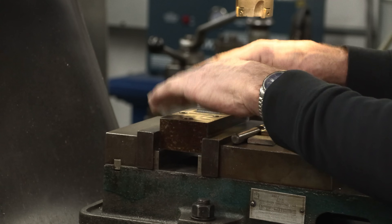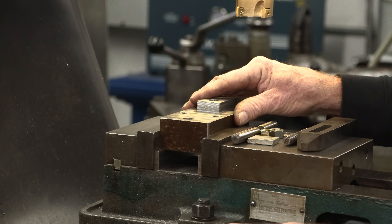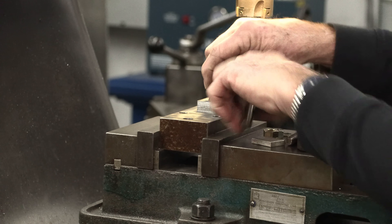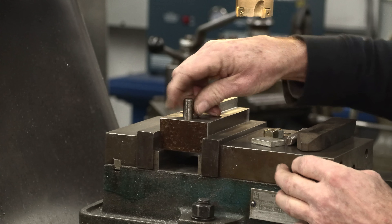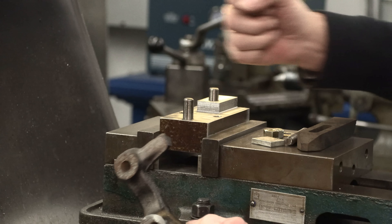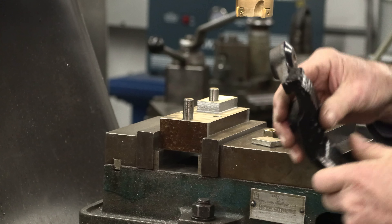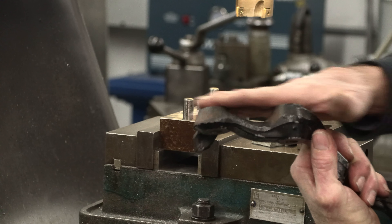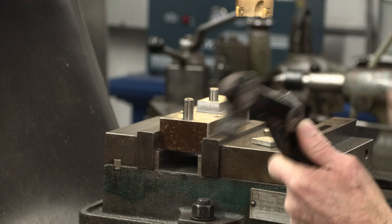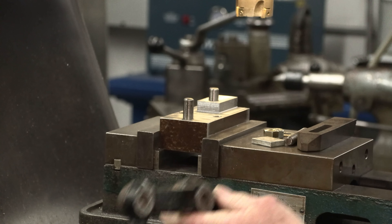This part can jig back in here if any other customers want the same modification done on the steering arm for the same project. I drilled two holes to drop these pins in to locate the two holes so that the part would be rigid and wouldn't go flying off of anything. Now, the two surfaces we're cutting are straight in line with each other, but the two on the opposite side are different planes.